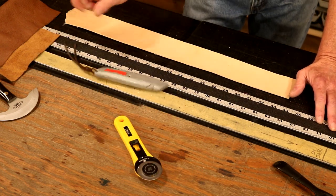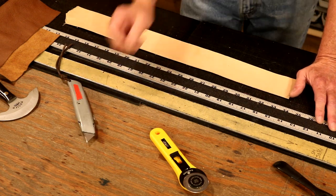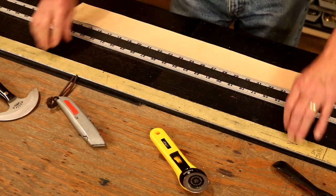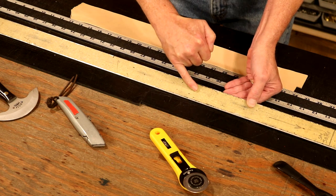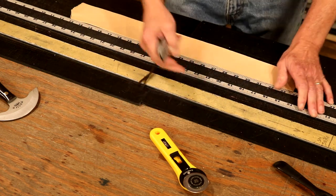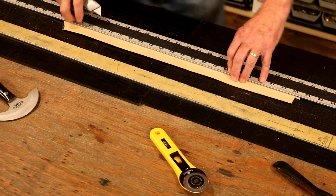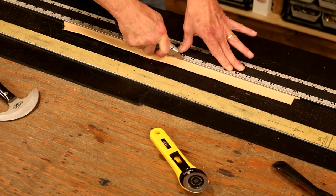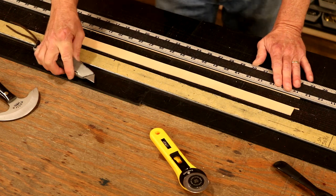Let's see if this helps. I use a box knife on everything — the retractable blade is a big help to me. But even this isn't perfect. The other night I had my knife on my table, didn't retract my blade, put some strapping on it, grabbed the strapping, and my blade got a pretty good cut out of that. And right here, this is one of my straight edges from my shop — there's a cut that stops abruptly right there. It stopped abruptly because that was my thumb. So we've got to be careful of our knife jumping our straight edge. Try this: let's keep our hand always behind our knife. I've got a straight edge and I'm going to get a good cut going, but notice I'm going to keep my hand behind my knife. I've still got good pressure on my straight edge, but my hand is always behind my cutting blade. And there we are — we get a clean, safe cut.